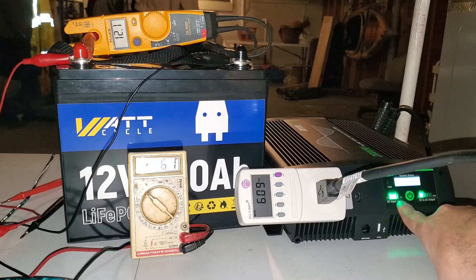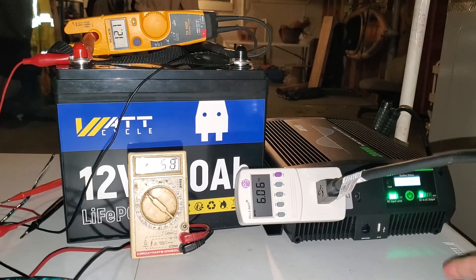The DC input level on this inverter now shows four bars out of five, so it does show a little bit of depletion — however, it is under load. When the furnace is idle, it comes back up to five bars. Right now with the furnace running, there's about 20 to 30% of the inverter's load capacity being consumed, with plenty of overhead remaining. As of right now, we are going into hour number four, and we still have plenty of juice left on this battery to keep this furnace running, keep this house warm, and keep my family warm in the event of a power outage in wintertime. Here we go, hour number four.